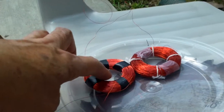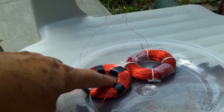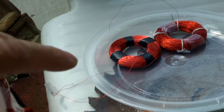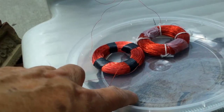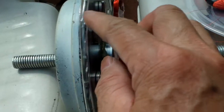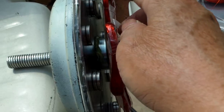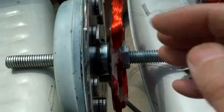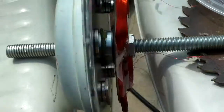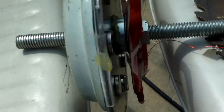I had wound some other coils. So far I have wound 2 — this is 32 gauge wire, and maybe I can wind just 6 coils and make a stator, and put it in the back like this — a single plate rotor instead of dual axial flux. That would simplify things a little bit and would stick to my toy configuration instead of something that can really generate some power.